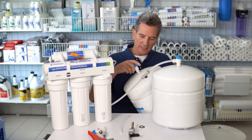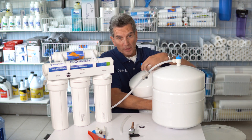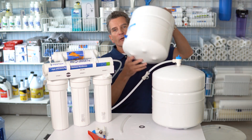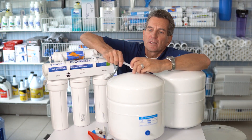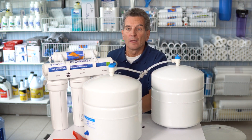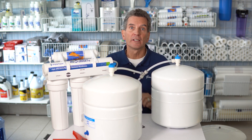All the fittings I'm talking about in this video I'll put links in the description below so you know which ones to order. Although this is for a 3/8 inch tubing system, I'll also put links for the same items you'd use with a quarter inch system if that's what you have. Then all you do is hook the tubing up to the new tank and connect it to the T. You can put the second tank right underneath the faucet even if the first one is in the basement — to optimize flow, right underneath the faucet is the best spot.